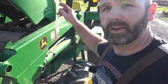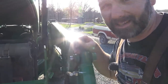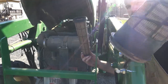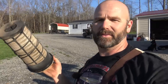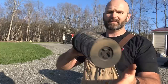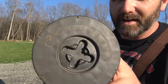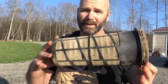That did the trick. Now here we are at the last thing — we're going to pull the air filters out, which is pretty simple. They're a two-stage, oil-less air filter. Pop these two clips, twist the filter a little bit, and slide it out. We have an inner and an outer — you just want to make sure they're both clean. Take the air filter and blow it out; you can reuse it probably several times before you need to replace it. Let's see how much dust is in it — it's not too bad. We'll gently blow the inside first, then the outside with the air hose. The reverse installation: it tells you right here — twist it to lock. Slide it back in, turn and lock. It's really not that dirty, so I don't even think I need to blow it out — we're in good shape.